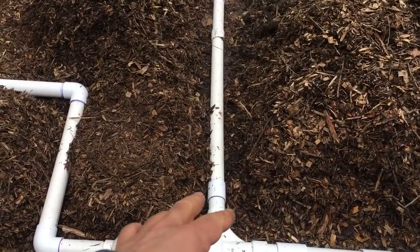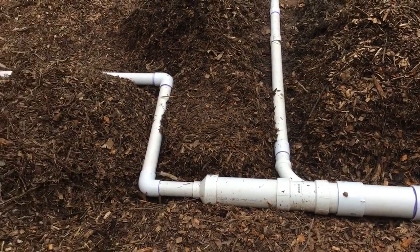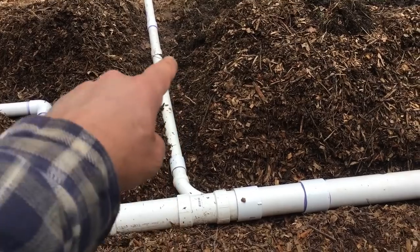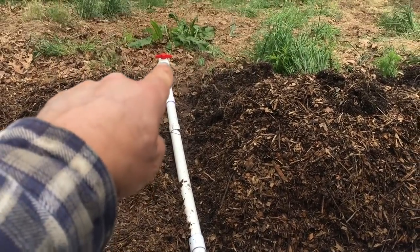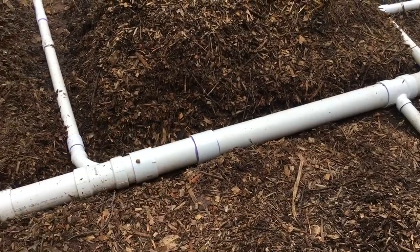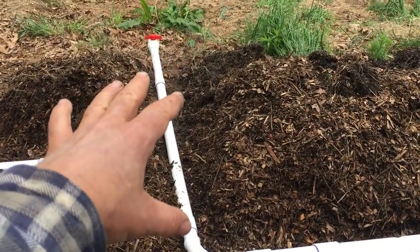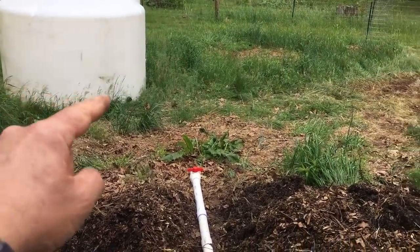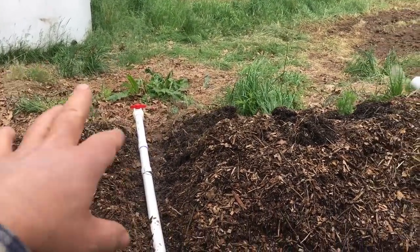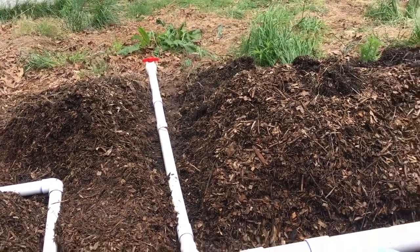Because I'm in a cold climate that does freeze, I need to be able to drain this system. I have everything leveled so that this is the lowest point in the pipe right here, angled going down, and I have a ball valve out there. All of this will be covered up — I have it exposed right now for the purpose of this video. That ball valve end will be sticking out, and during winter I can drain everything. Eventually I'm going to have a swale here — 1,300 feet across the property — and that water will go into the swale and be kept in the landscape.